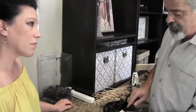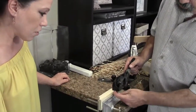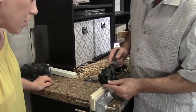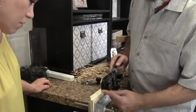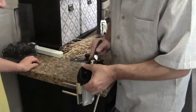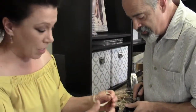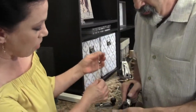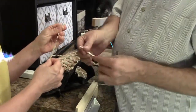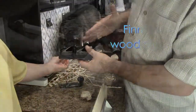Okay. So you can just make whatever piece of wood you want for the frame on the front right, and then you can come back here on the side and with this plane, I set the fence against the wood, and that prevents me from going in any further this way. So however deep I want it to go that way, I do that. And I'm just going to go right across like that, and see, there's the shaving. It's super thin, so you can kind of see that. It's not taking off a whole lot of wood at a time, so you can't get in trouble with this very much either. No. Yeah. And you can control how thick this is by raising and lowering the blade.